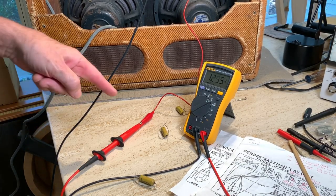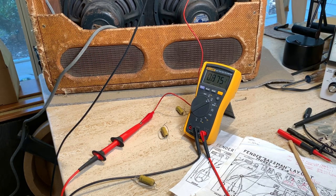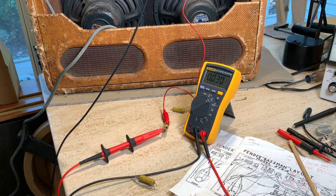I've got the probes connected together, just verifying the voltage — it should be around 202 volts. That was right on 202 volts. That's a lot. The sad part is these eBay sellers will tell you that they've tested the caps for leakage with a capacitor analyzer, which I wish I had — but that's not always true, if ever true.